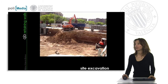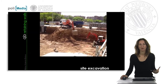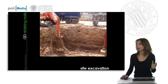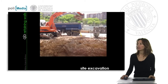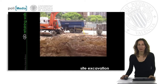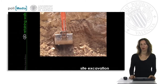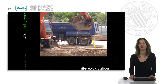In some specific cases we are also making the whole surface of the retaining wall. The soil is strong enough to support the loads and we can excavate it continuously, but a small digging machine and a big digging machine are making it by pieces and over the whole surface. In all cases we have to finish from this last small unit of land we keep in the construction. This excavation is done directly and we don't need to keep any piece of land to support the subsoil, because the soil resistance allows us to do it as a whole unit.